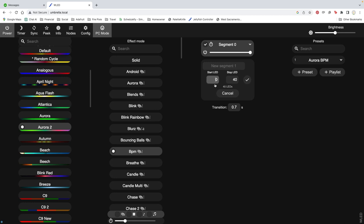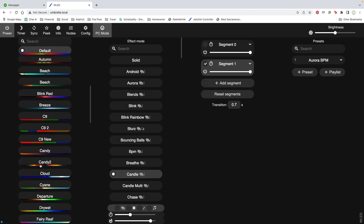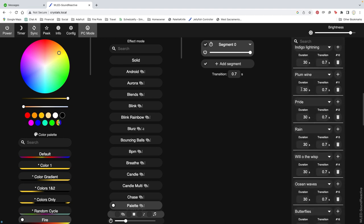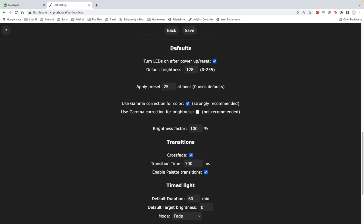Head to umbrella.local in your web browser on your computer or your phone. We have two different light strands soldered to two different pins. By default the tentacle lights act like an extension of the top lights — WLED treats the two pins like one continuous strand with 40 lights. You also have the option to treat them as two separate segments and run different animations on the two areas. See what configurations you like. Choose an effect and a color palette and watch your lights change. When you find a setting you like, you can save it as a preset, then string all your presets together into a playlist. You have control over the order of presets, the length of time they play, and the transition time. Since I'm taking this out to a festival where there won't be Wi-Fi control, I'm going to set up my playlist to start automatically when I turn it on. Take note of the number assigned to your playlist. Click config and LED preferences, then scroll down to defaults. You can tell it which preset or playlist you'd like to start with by entering the number here. This way your project will still run your animations even when you're not near a Wi-Fi controller.